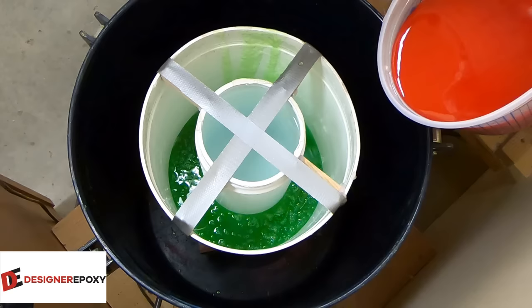But this is why I've never used a balloon inside of my castings, filled with water or with air for that matter. If you fill it full of air, once you pressurize it, the balloon's going to shrink, and then it's not going to work for you anyway. Now, if that balloon is full of rice and it's open at the top so that the pressure can be equalized on both sides of the balloon, yes, that would work. But I find it easier just to stick with the two kitchen bags and fill them with rice and not deal with any of that other stuff.